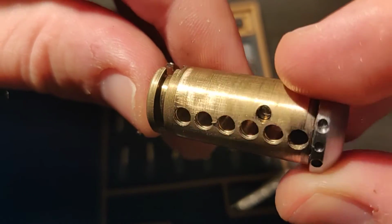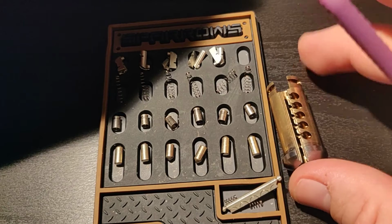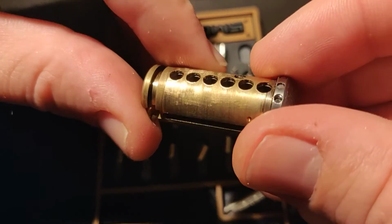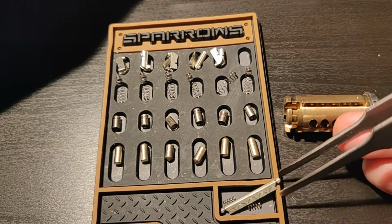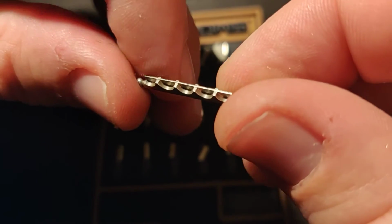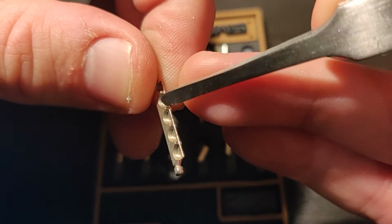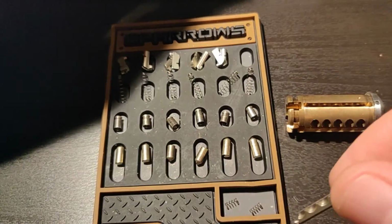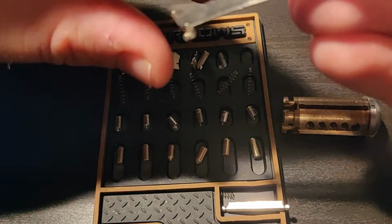Partly because this lock is new, but the whole tolerances in this lock were really mean. I mean the main stack tolerances were really tight. Okay, and the most interesting part about this lock are the side pins. Well, let's just see the sidebar. Doesn't look too special, but there's no bitting on it. It's straight basically. It's not like other levers in other locks. It's straight and it's kind of sharp, and the sidebar code itself is coded inside of these tiny little guys.